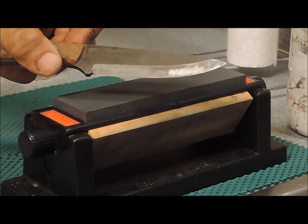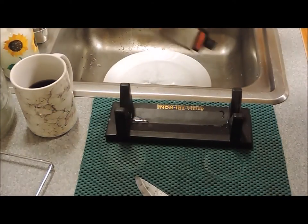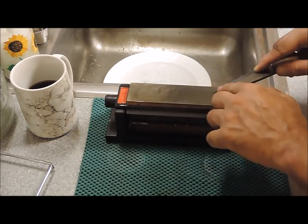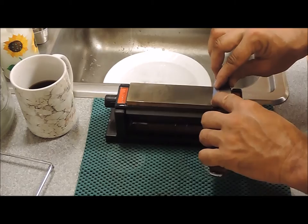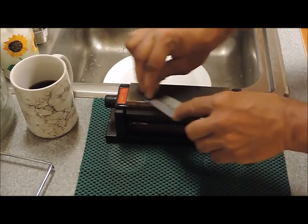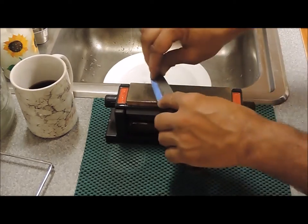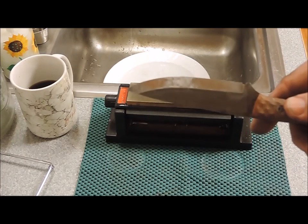Find what works best for you. I'll hit the other side and do that exact same process on the other stones. So we finished up with the coarse side, soaked the medium stone, and now we're going to repeat the process with the medium stone. The coarse stone puts scratch marks on the blade — I want to come to the medium side and remove all of those marks. When I get to the fine side, it's just to give it that finish polish. I'll continue to work on this blade until all those little scratch marks are gone.